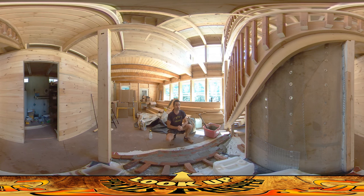What makes it perhaps the most exciting is that River is helping. He's prepping all the bricks outside — we've got that pile out there. He is scrubbing them off and getting them into a soap bucket to try to get them clean and moist, so that when I put them down here, they're not drinking all the moisture out of the concrete that I'm putting between them.